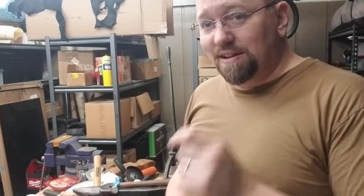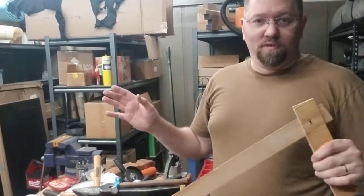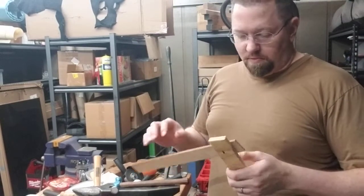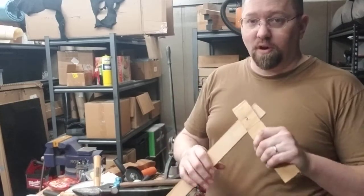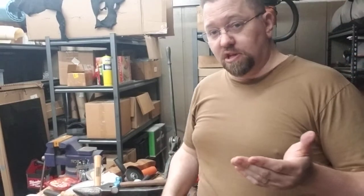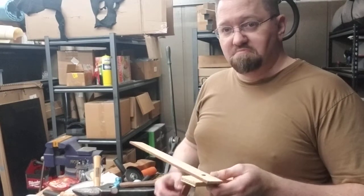If you can't go to the hardware store and find the exact right size nail for your project, or the exact right size screw for your project, you'd have nails sticking through stuff all over a medieval house. What do? Just dead nail them, clench them, just fold them over. So let's say you're attaching hinges to a medieval chest. Clench nails work beautifully.